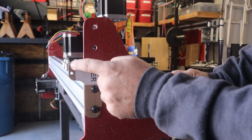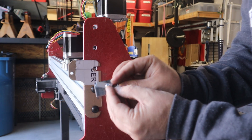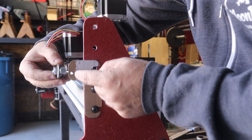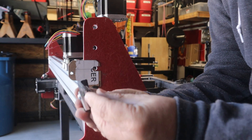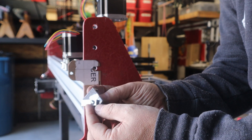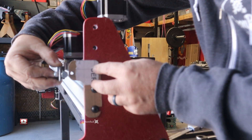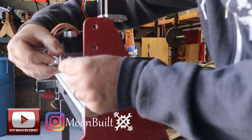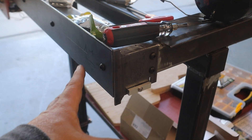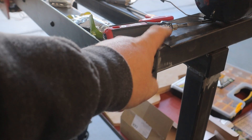On one end, the belt comes around, and with one of those mounting tabs — these locking strips — it'll screw right to that. This is actually going to be my belt tensioner for this side. The bolt goes through this hole. I took a piece of angle iron, welded a nut to it, then drilled and tapped the hole. I took one of those locking strips, cut it in half, and drilled and tapped the hole so the belt gets locked to that. I'll be able to adjust the belt tension by tightening this bolt right here. I need to get these brackets cut out of some eighth-inch plate first — the same plate I used to make the side rails and end plate brackets, since I have a bunch of that left over.